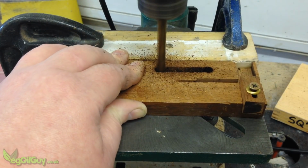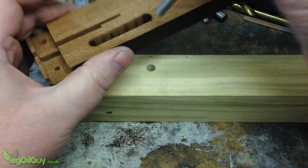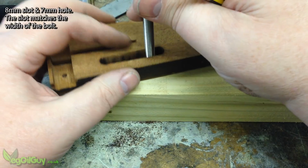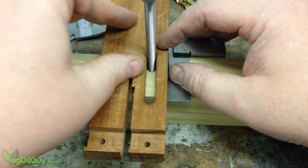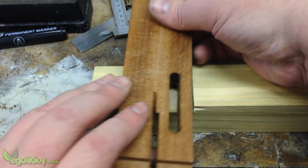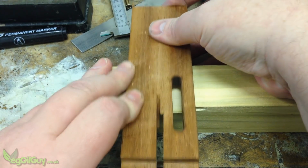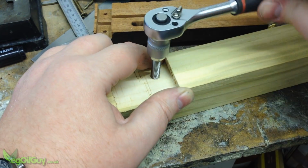I drilled an 8mm slot into the suspension block. I then removed the arm and drilled a slightly smaller hole into this. This allowed me to partially screw in a bolt. I cut away another shallow channel and then screwed in an 8mm headless bolt, roughly an inch deep.